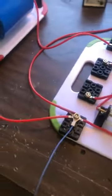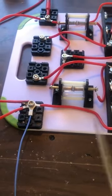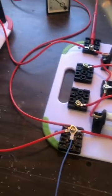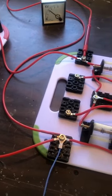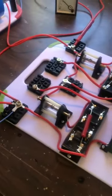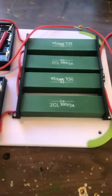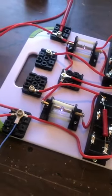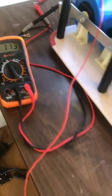So now she's zipping along a little better. Again, not really much change there in the voltage. The speed that this is interrupting in has gone faster. That voltage is climbing slowly. And we don't want it to go to the point where it exceeds what we can deal with. So the way it's set up, it appears very stable. About 400 to 500 volts out when it's not being silly.